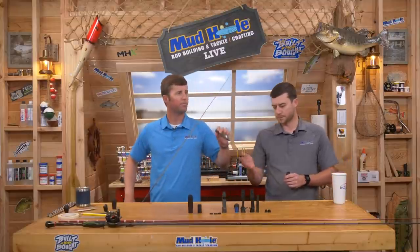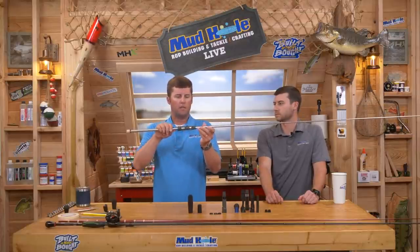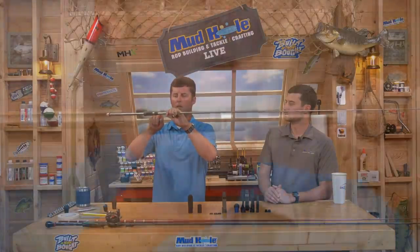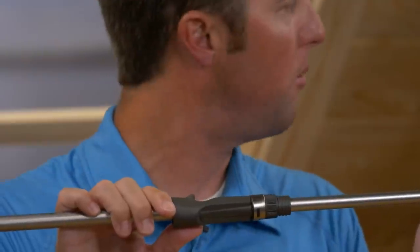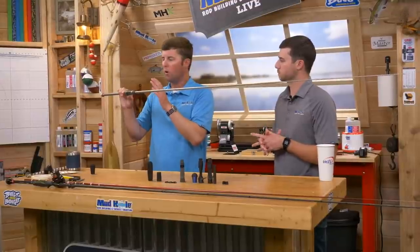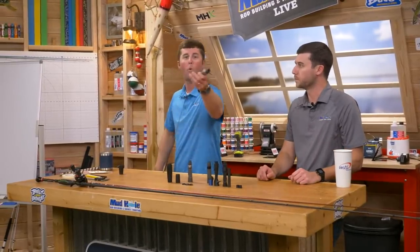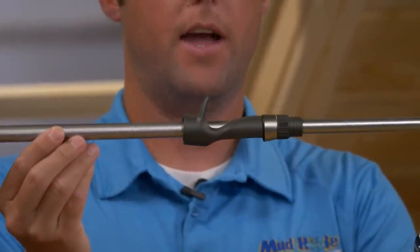Let's try the 13 first. You can see where it stops. The best part is, if it does stop where there's still a little taper in the blank, there's very little wiggle up in the front. The 13.5 is really pretty much perfect — it's snug there, doesn't want to move, and that's right where we want to be. I'll mark this — I brought a white and black china marker because sometimes the white is hard to see on metallics.